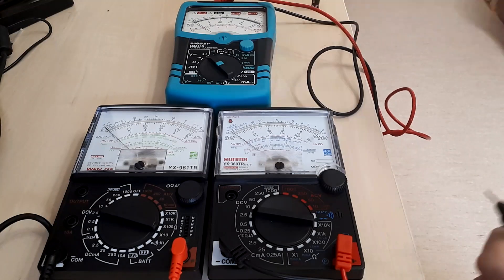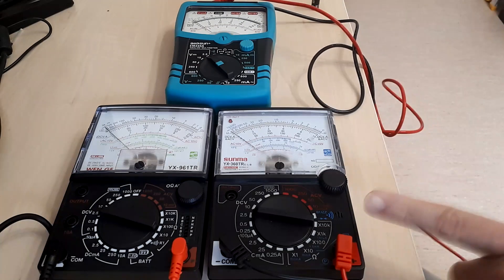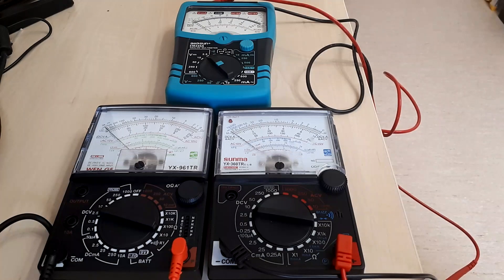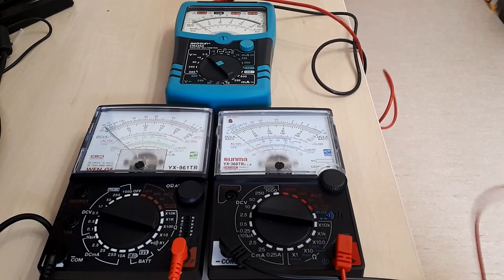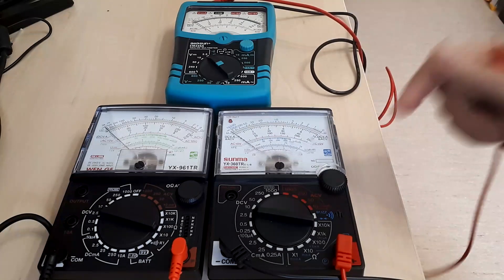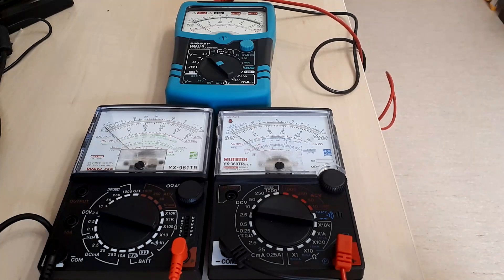You have noticed that there was a certain amount of time between the moment I applied the voltage and the pointer deflected. Look closely at what happens with this device. Right away you notice two aspects: the deflection was much faster and it had a bit of time until it stabilized. This is actually a telltale sign of a multimeter that has quite poor accuracy.